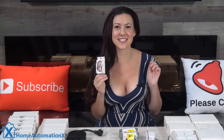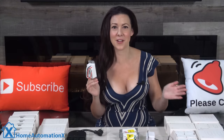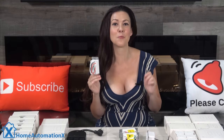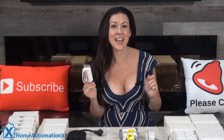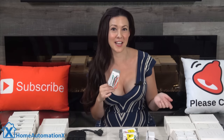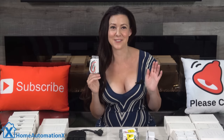This one here is a single pole switch and they sent us a bunch of them. We already installed them throughout the entire house and they are labeled at the back — green for the ground, white for neutral, black for the line, and red for the load, the load being the black wire going to our lights. They are all set up and as soon as we show you all the action in the house, you will understand.